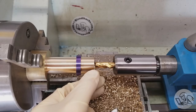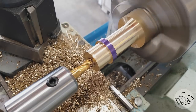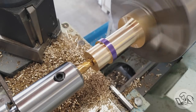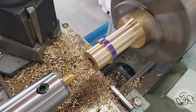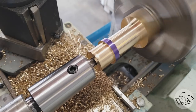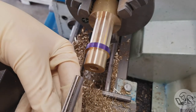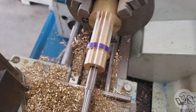So again, I used that trick for finding the surface, and then I proceeded to wind in with this end mill. Now, end mills are not reamers, and when you make an end mill cut on more than one side at a time, it cuts oversized. These are all things I know, and for some reason I just forgot that I know all those things, and I proceeded to try this stupid idea anyway, and I got chatter in there like crazy, and the hole came in too shallow, and this was the point I realized I had used a non-center cutting end mill. One more mistake for the pile, so I went back and looked a little harder, and I did manage to find a 3/8 2 flute end mill that would properly center cut the bottom of that hole. But then I went in and checked with my 3/8 reamer, and yeah, it was quite a bit oversized.